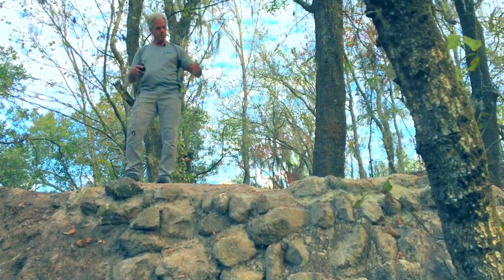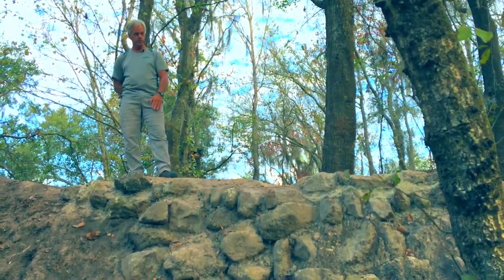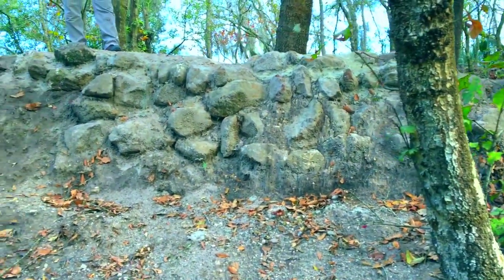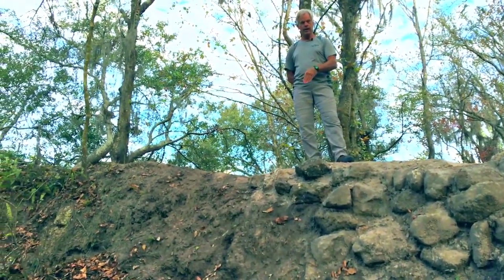When we build these rock walls to hold up the trail, we make sure that we make long layers. We build the trails with the rocks lined up lengthwise perpendicular to the trail. And because the rocks are not smooth touching each other, we have to make sure that we put lots and lots of clay mud down in all the gaps.